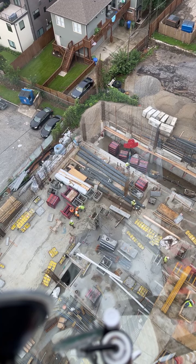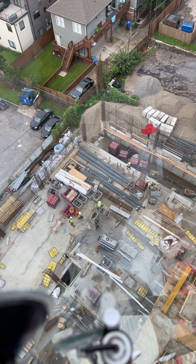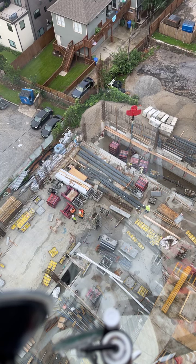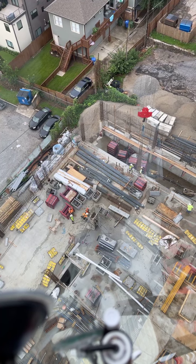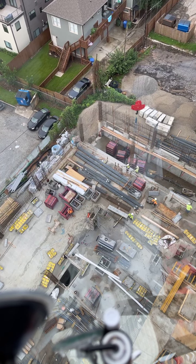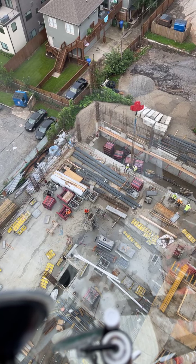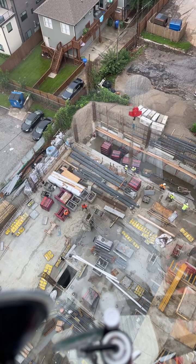Now I'm gonna cable up, and then I'm gonna boom down. Very good. I'm gonna boom down and try to get it in the position. Keep it going down. If you cable up enough, when you boom down, it should just be right there for them. Going down. I'm gonna have to swing right. Oh, yeah. All right, going down. Okay, we're down. Hold it.